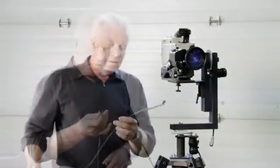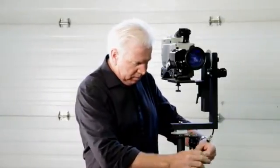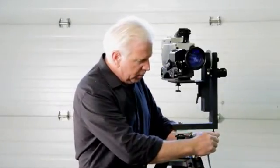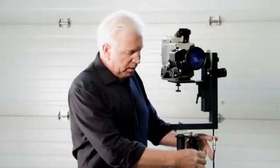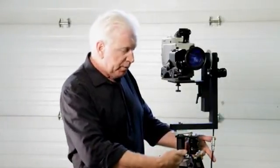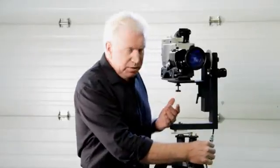Next, we're going to plug in the pan-tilt cable. The short end of the pan-tilt cable goes into the pan motor because it never moves. The long end goes into the tilt so that it can wrap around and give you at least 720 degrees of movement. Each cable can be plugged in two ways, 180 degrees apart — this controls the direction. If you're above a tripod or a jib arm and you move the joystick left, you want it to go left. If you put the pan-tilt below the jib arm, left would then become right. So you would just unplug one of these cables, the pan cable in this instance, turn it 180 degrees and plug it back in. The direction in which you place your camera on the pan-tilt also determines which way the tilt goes — you can change that by turning it 180 degrees and plugging it back in.